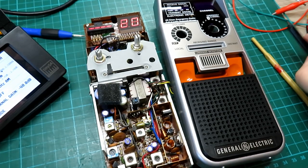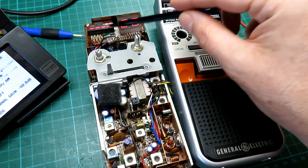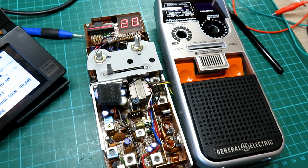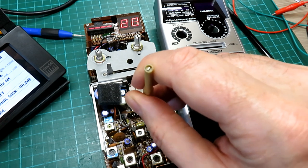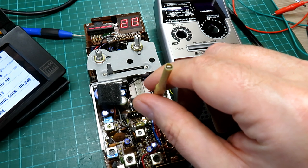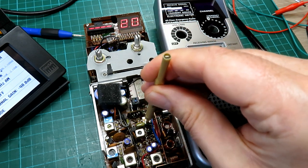Right, that just needs the squelch. I have adjusted the S meter. The four bars is S9, so the adjustment is just down there for that. I have done that. And I think then this pot here is going to be the squelch. So we've got our squelch set at maximum in this direction. We've got our 100 microvolt signal on, and we'll just adjust this till we hear it.